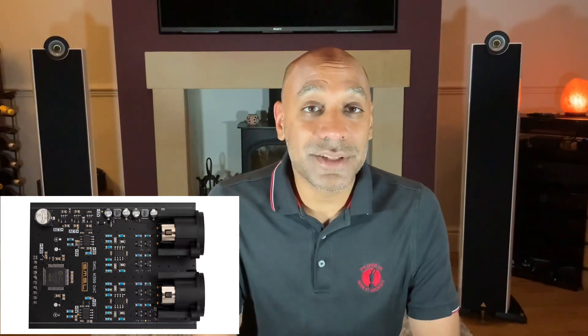If you take a look at the inputs you've got Bluetooth, optical, coax, and USB. You're well served with the outputs as well — they've got the RCA connections that you'd expect, but unusually at this price point it's also got balanced XLR connections. It's not like they've cheaped out on the inside either. The DAC chip itself is one of the best on the planet: the AKM 4497. Because of that chip it will decode pretty much every high-res file you throw at it — PCM files up to 768kHz and 32 bits, and DSD files up to 512. So the question is: is this at £213 all the DAC you really need, or is it too good to be true?